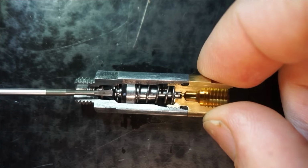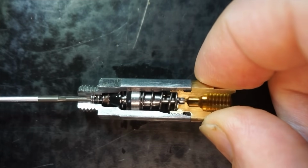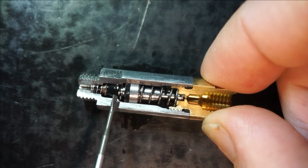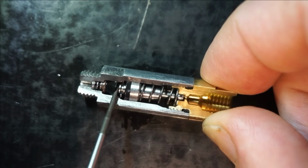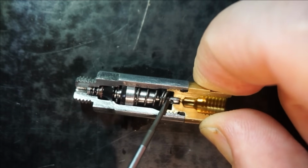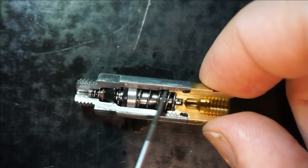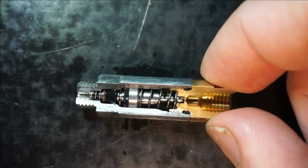Here, this piece, this rubber piston, is sort of a double check valve. So you see it moves in that fashion here. Then we have this turned steel piece here in the center, which is sort of like a tube. You can see it reaches from the screwdriver tip here to here, has a central hole that goes from here to there. And then there is this cross hole here. I hope you can see it. So this cross hole connects the inside of the tube with this chamber and with the discharge port. So let's think of all these three as one thing.